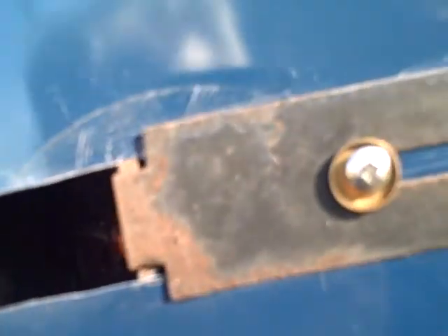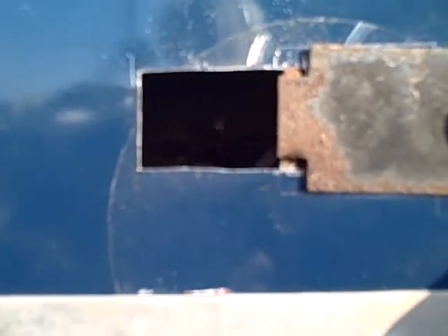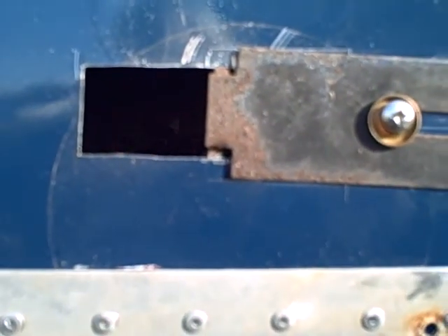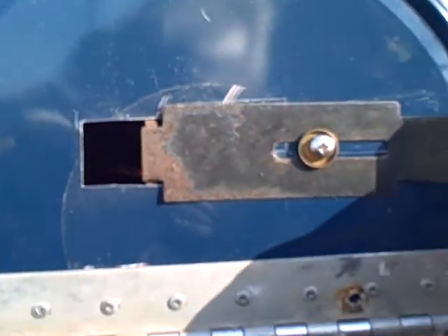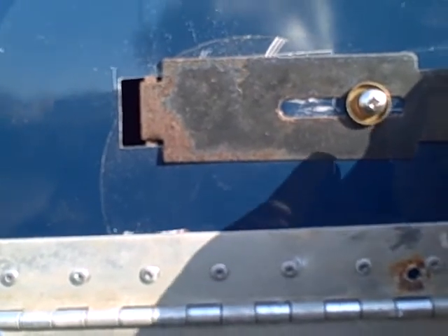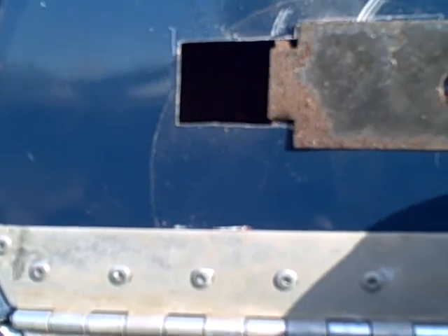The flame is going real well inside. The size of the hole that I have here for the air inlet is in proportion with the exit hole that goes up the flue. It slides along and I want to dampen it down.